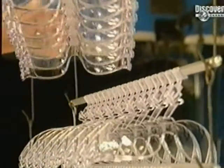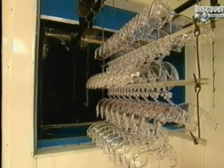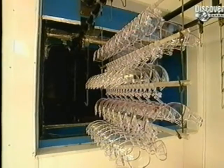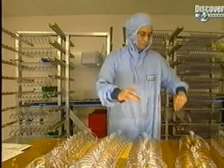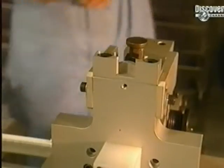The glasses are then gently soaked in a chemical solution which prevents misting and scratching of the lens. This coating now has to be cooked. The glasses are passed through an oven heated to 120 degrees centigrade. The soaking and cooking process can last up to two hours. Each pair of glasses is inspected to make sure there are no imperfections or distortions in the lenses.